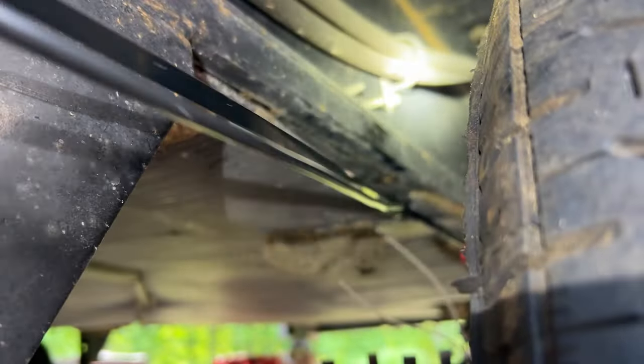We ran out of Butyl tape and bought one-sided Gorilla waterproof patch and seal tape at Lowe's. Both can be used for self-sealing to prevent water intrusion and protect the panel feet from cutting into your roof while in transit.